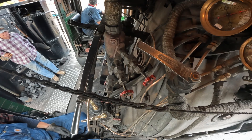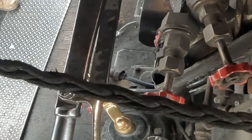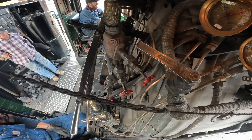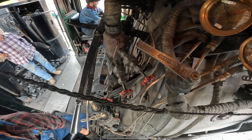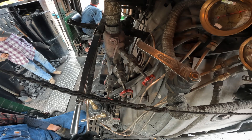I was able to get a super wide view in the cab where you could see what the engineer — in this case my buddy Paul, thank you Paul for letting me film you — you could see what Paul's doing with the automatic brake valve, which is the large brass handle, and the independent brake valve, the small brass handle. And then at the upper right, you can see the duplex gauge that shows our main reservoir and equalizing reservoir pressures.